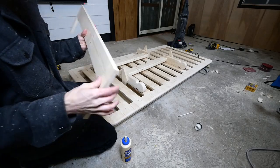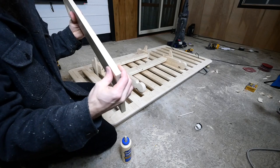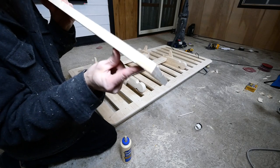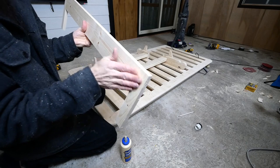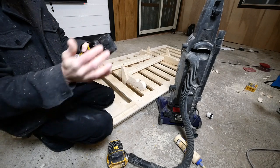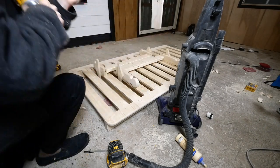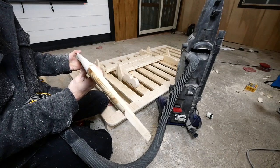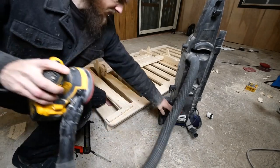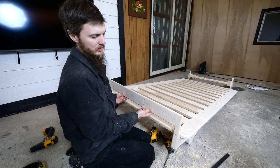I thought I was recording but I wasn't. I glued these and just tacked them together with some brad nails — that's all I did was overlap those. You can see I actually didn't do a perfect job because it doesn't line up very well, so I'm going to sand it smooth so you lose that little edge. Let's make it match the bed now. I'm just going to route these edges starting here all the way around, turn around, do the same thing. Alright, I'm back and this is looking really cool other than a little uneven — let me get it sanded down.